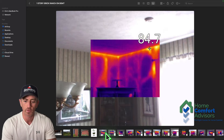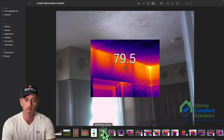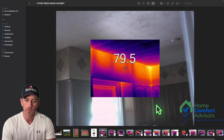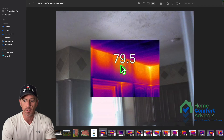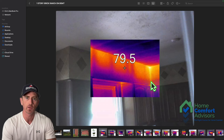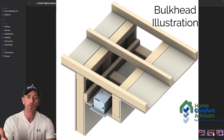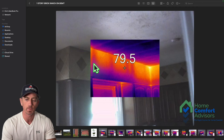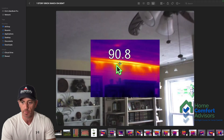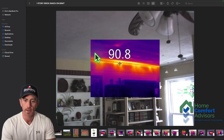I'm going to show you more infrared pictures of things that were missed. This right here is a soffit or bulkhead in a kitchen — you can see the kitchen cabinets and above this area is the attic space. This bulkhead, because of the way it's framed, is basically open to the attic above it, and you can tell it was not insulated before the radiant barrier was installed. The top half of the bulkhead is really hot, with a lot of heat transfer happening through it.